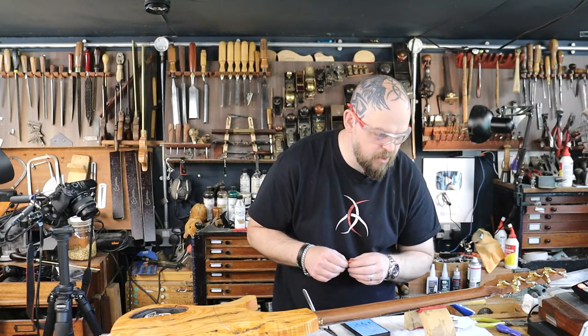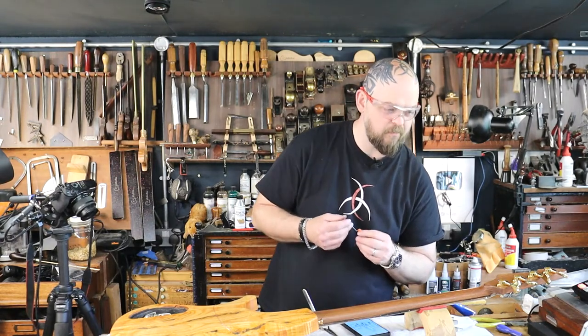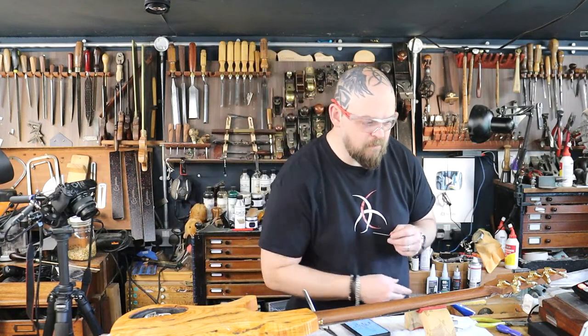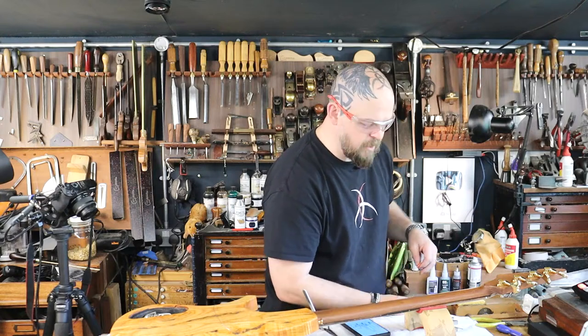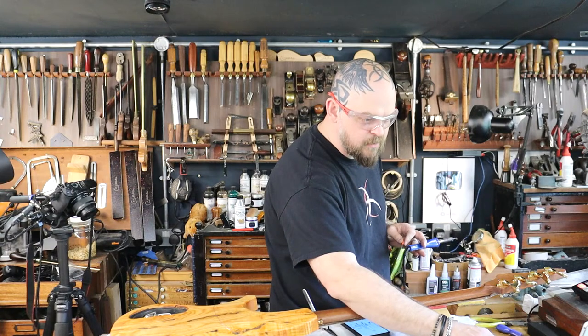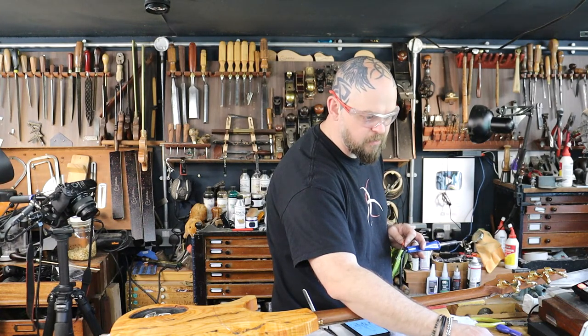Part of him cringes every time you use the iron to carry solder to the joint, but it's the easiest way to do it without having three hands. Fair point. FFS 987 says you should heat the joint, then add solder to it instead of adding solder to the iron and placing that on the joint.